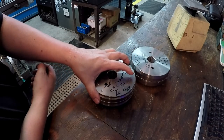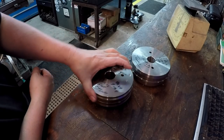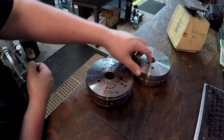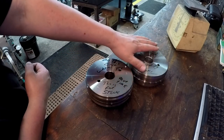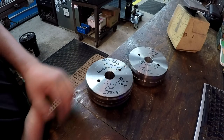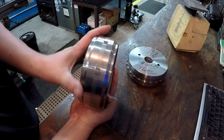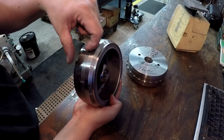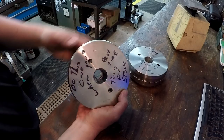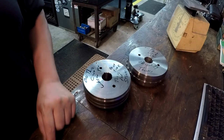What I have here are two flywheels from the motorcycle shop — I believe these are Triumph flywheels. There are two different models: one is for a fuel-injected bike and one is for a carbureted bike. The flywheels are the same size, but the little machined divots have to do with timing, and those are in different places — that's what distinguishes the two. One is for a customer bike and one he likes to have on the shelf. I'm showing the little divots machined into it that you have to stay away from — you can't cut those. What you're going to do is remove the material up to that point, take the diameter down, go along the face down to where those two holes are, and remove some metal off the back of the flywheel.